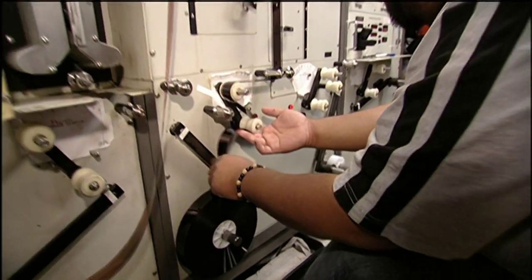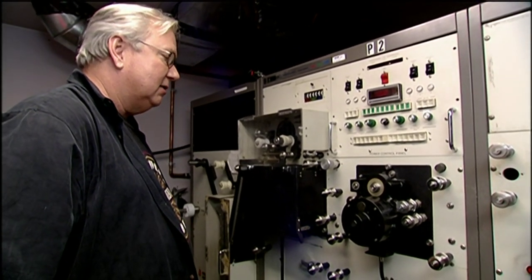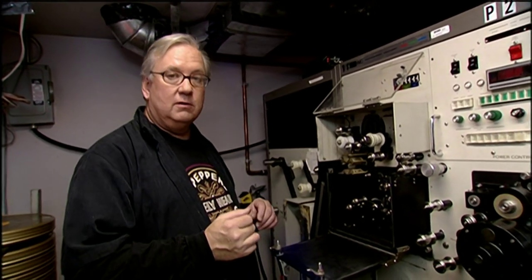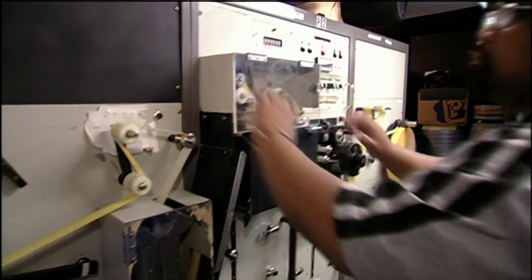This is a wet gate contact panel printer that we use to print Help in various stages of the process. What this machine does is it duplicates exactly the original negative material to modern day film stocks. It's especially handy for a show like Help which is 40 years old. Over the years it can collect quite a bit of surface defects and blemishes, and this machine will actually remove them while it's printing. When light hits a film and you see scratches on a screen, the light hits the film and when it sees the scratch it bends — causing a visible scratch. What this does is fill with liquid, which fills in the scratches and allows the light to go straight through the film, thereby eliminating the scratch and surface defects.